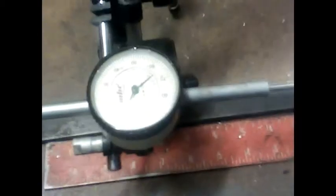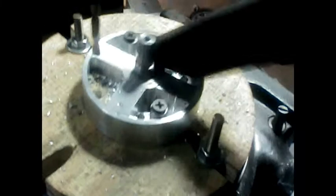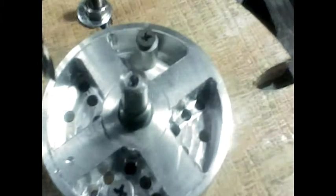Okay, advance the table at 107. There's 7, 1, 2, 3, 4, 5, and the last hole. These are all the screw holes in the drill, okay. So all of the holes are now drilled. And now I can take it off. Now I could take the whole plate off, turn it around, and do the milling. We'll see how that comes out.